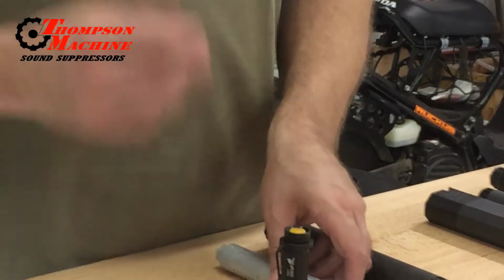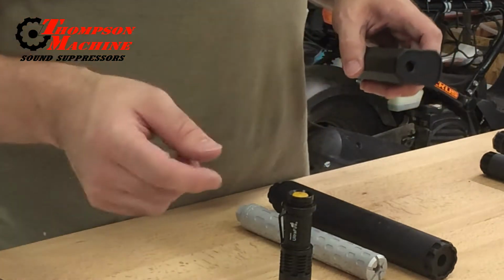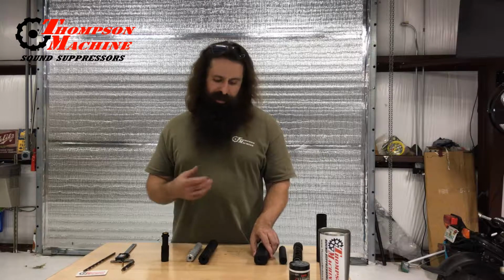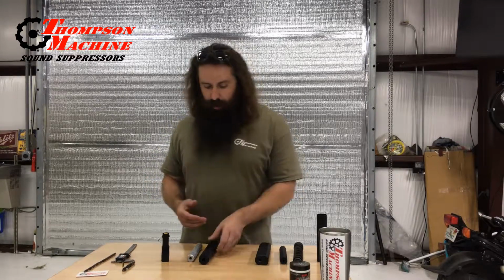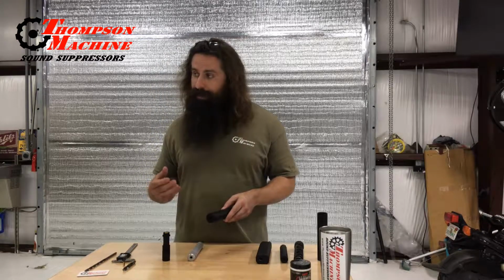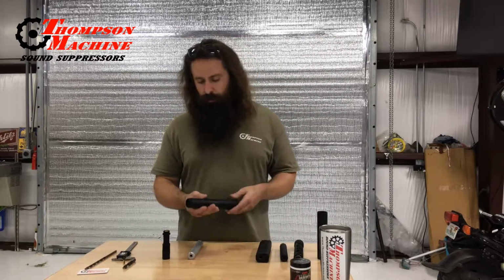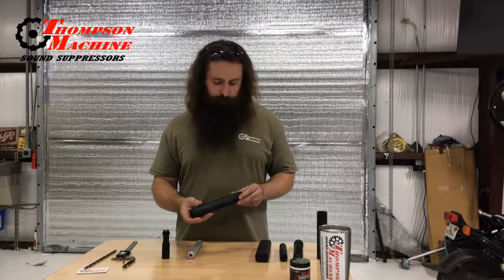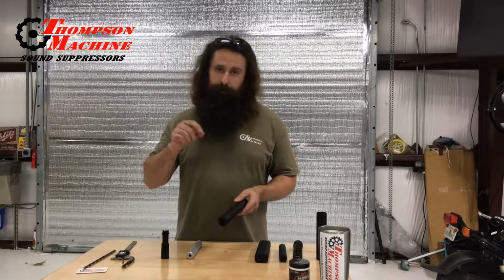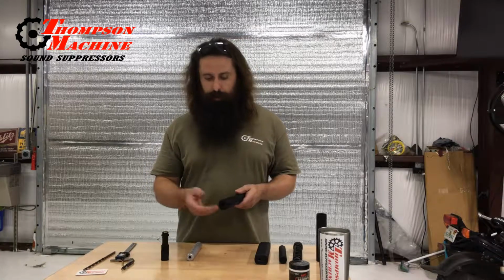We do the same thing in our 9mm cans, like our ISIS 2. We've got an Osprey here, and this can runs about a 400 thousandths bore. Projectile is .355. So, once again, you're somewhere in that 20 thousandths range. In ours, we run a 440 bore, so 440 thousandths bore, so a whole other 40 thousandths of an inch clearance for the projectile if your can comes a little bit unscrewed, or you've got a barrel that's not threaded perfectly, or there's a little piece of carbon or something in between your barrel shoulder and your piston in the case of a pistol can.